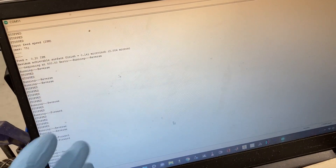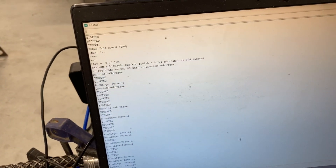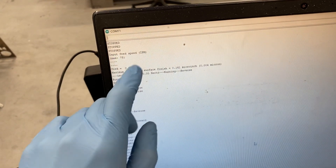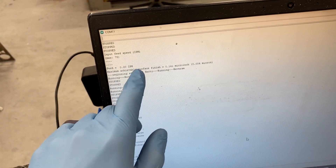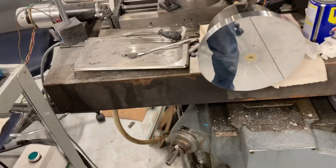What it does is it takes into account the tool radius, the spindle speed, and the other things, and it finds the absolute kinematic limit to how good your surface finish could be. So for our finish pass — this is what we just did — we did 0.2 inches a minute. And with the tool that we're using, that gives us a 4 nanometer surface finish. Now obviously that's not a 4 nanometer finish, but that's the absolute limit. If we did everything else right, that's what we could expect to see.